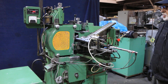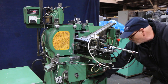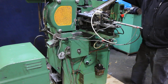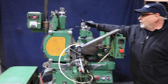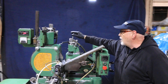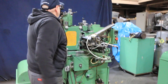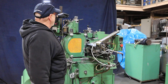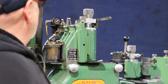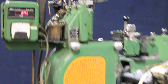Most of the primary stuff is here. Basically you've got your regulating wheel which adjusts the speed down here, you've got your grinding wheel, and you have your two wheel dressers here that are controlled hydraulically. You can adjust the speed and you've got your micrometer, as well as the grinding wheel dresser. This follows a template depending on the part you're grinding — you can have different templates made up by Royal Master. This is an RPM readout for your regulating wheel and your coolant system.